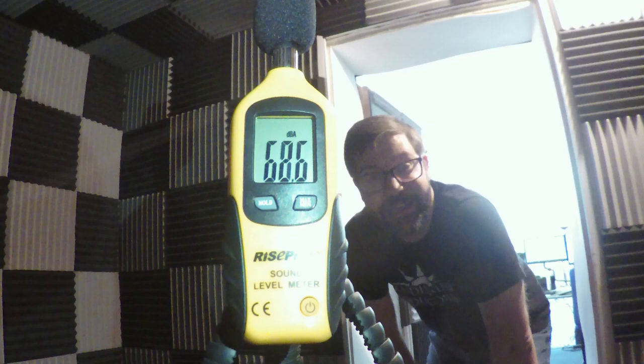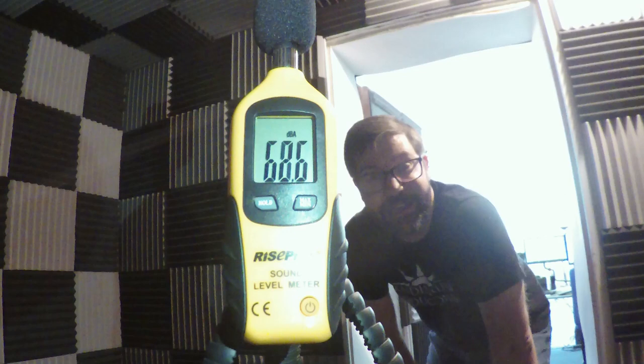I'm not planning on facing the door at all — I'll probably have my back to the door so I can have the light on my scripts. I just did a little bit on the door to help break up any stray reflections that may happen. It's done. So what I'm going to do next is another sound test using the sound meter. I'll have the kids go outside, hoot and holler, and we'll see just how much of a difference it makes. I'm guessing it's not going to be completely perfect because of how we did it — only the mass-loaded vinyl on one side — but it's going to be a whole lot better than before. We'll start with the door open and then close it and compare the results.